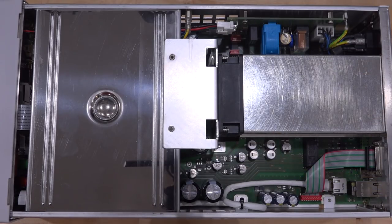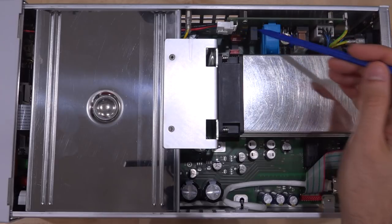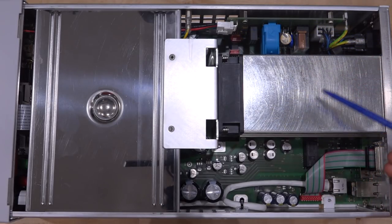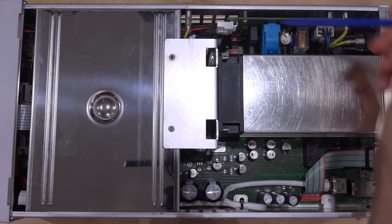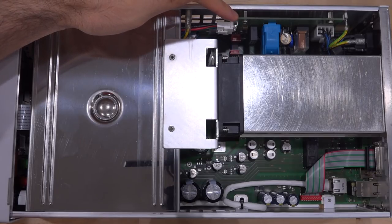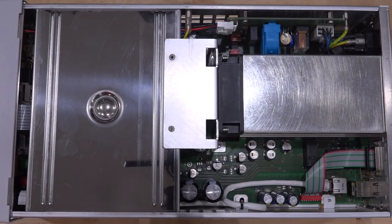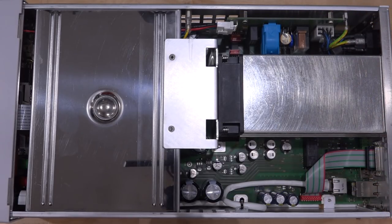A connection from this main board onto the main PCB is used to monitor the line frequency coming in — useful to align analog functions with that frequency so you can eliminate its effect at the output, whether for noise reduction or monitoring. The power switch is mounted on the other side and is a hard power switch — pressing the front panel button moves a rod that switches it, disconnecting most things from the line. Good earth connections on every side.